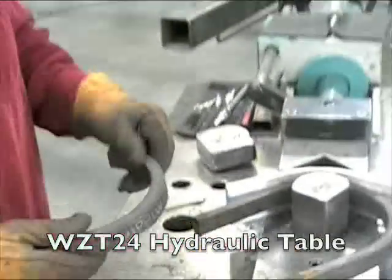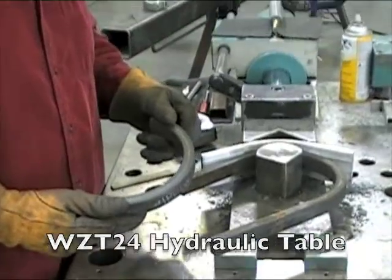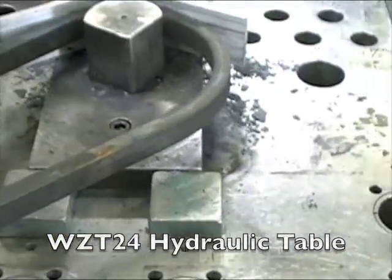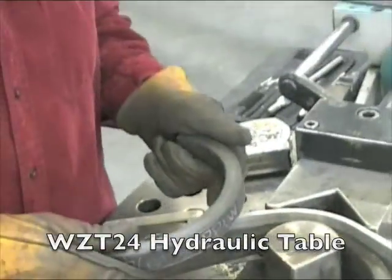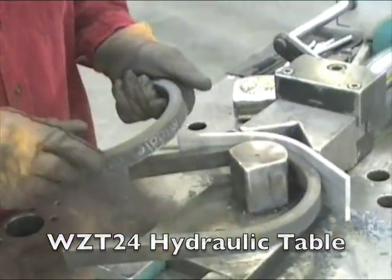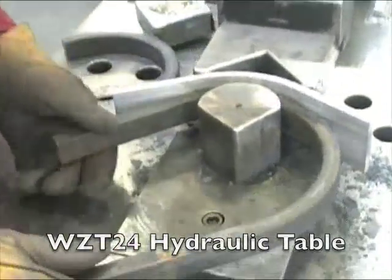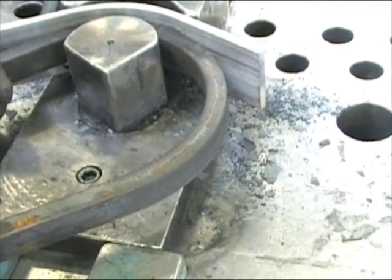Hi David. This is the inner circle. This is a six and a quarter inch radius as opposed to the six and seven-eighths on that. So what I'm using the hydraulic for — instead of making a whole new fixture for just rolling that inner piece — I'm using the hydraulic to bump it around. And I've put a piece of aluminum here so it doesn't scar up the material.